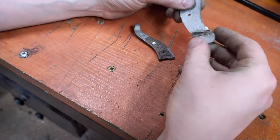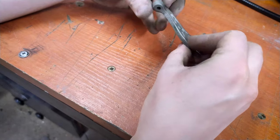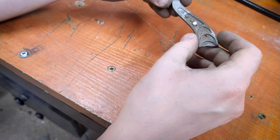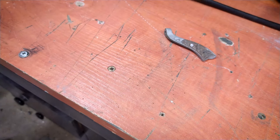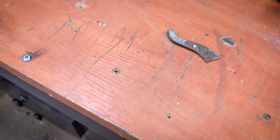Okay, so the brass has been polished and the metal plate connecting the frame and the rack is removed. And because the rivet seems to be tightly fitting in the hole, I won't remove it. Just file some extra material from it and use it as a hole filler. Fingers crossed, it won't be really visible after sandblasting.